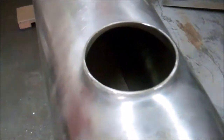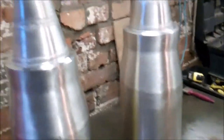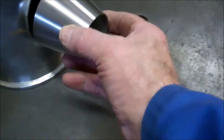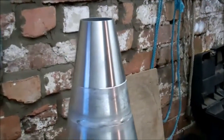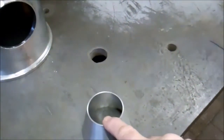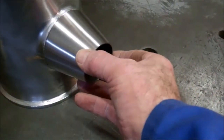Got that ground flat and level - that's square. Got all these ports squared off. Now I'm ready to weld the cone reducers on. There'll be a three inch to two inch cone reducer on these ports, and a two and a half inch to one and a half inch on the end ports. There'll be threaded fittings on the ends of the cones. I'll put the threaded fittings on the cones first - it's easy to do it that way - and then put the cones on afterwards.